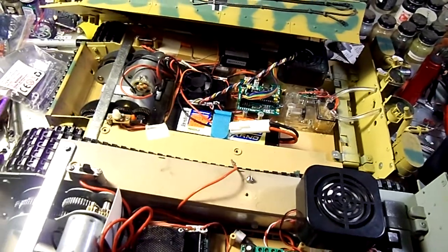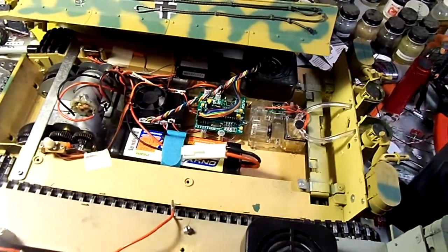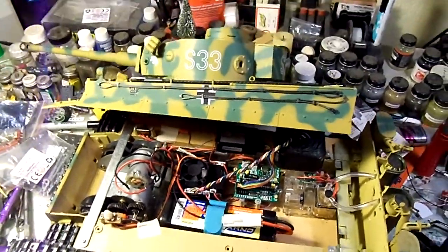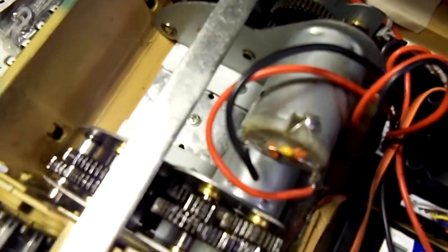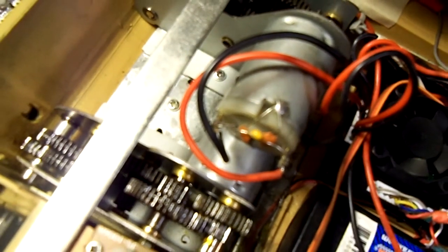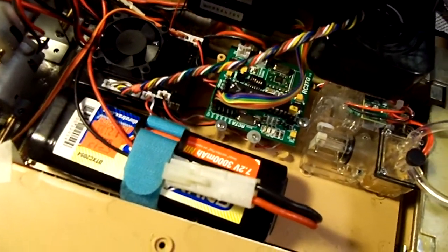He's been so patient, talked me through this stuff, and has been just terrific to a newbie rookie like me — a great guy to work with, and his prices are good too. On the S33, the only thing I might still do is add a Komodo. I've been having some problems with electromagnetic interference — so much new science for an old hippie like me to learn. I've had to add an extra capacitor to both motors, and this has helped quite a bit with the EMI.